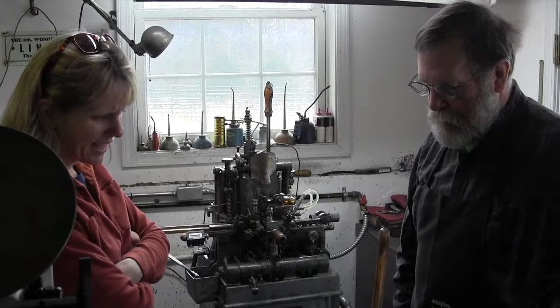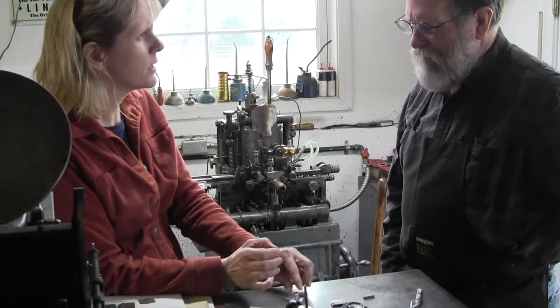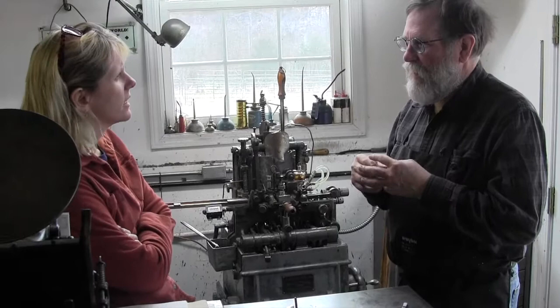Yeah. So these, basically, you don't have a lot of cleaning to do afterwards. No, they're ready to go. Do you have to look at them to check them? No, they're pretty much clean every time. After it gets going, you throw away the first few casts just because they could be cold, or there could be something in there, but after they get going, then they're fine.